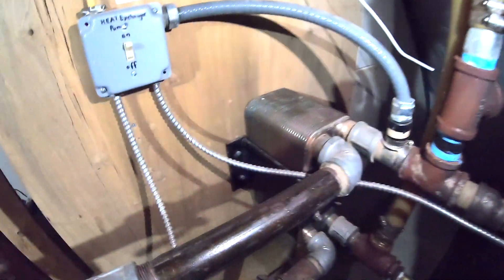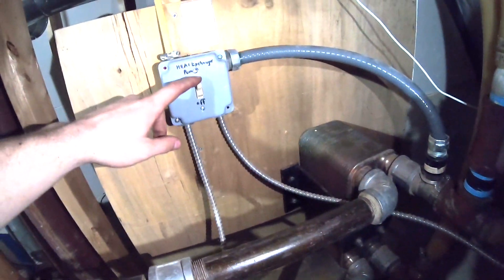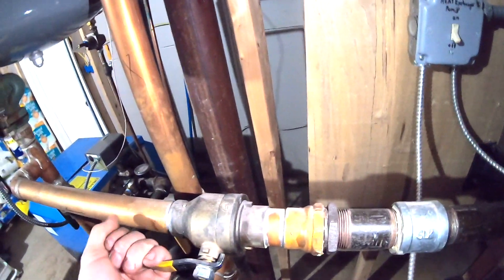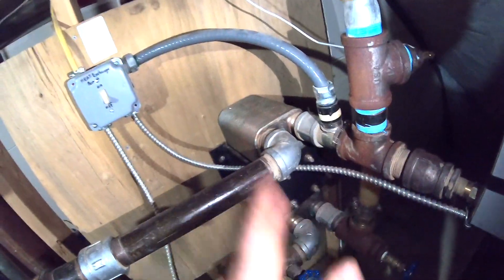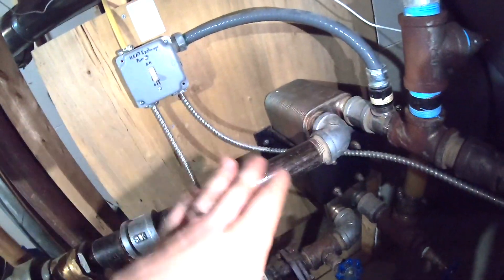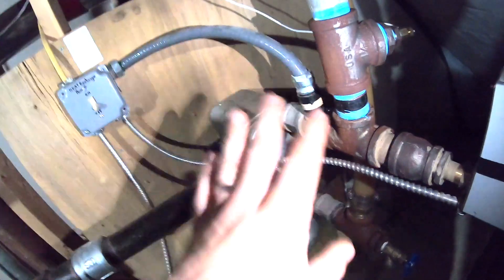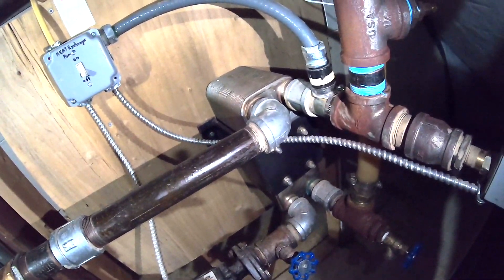This is the plumbing of the boiler — this is where the PEX comes in and runs through the heat exchanger. We shut off the breaker, which shuts off the pump at the boiler. We're going to shut off this heat exchanger and then close these valves. With the pump off and these valves shut, the heat exchanger is no longer running, no longer circulating, no longer transferring water from the outdoor boiler throughout the house. We'll need to start this back up when we do our water flush, which will be in a future video.